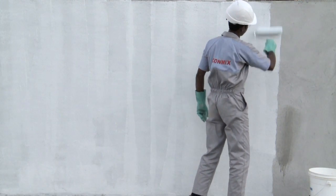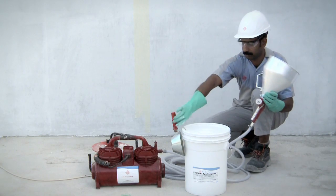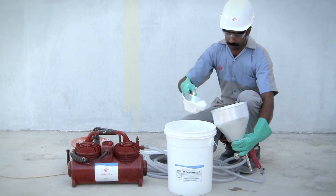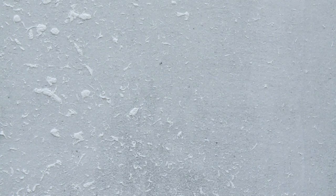Tyro compound has to be applied between 6 to 24 hours after the application of primer. It has to be stirred thoroughly and sprayed as a thin coat up to a thickness of 0.75 to 1.75 mm onto the prepared surface using the hopper assembly.